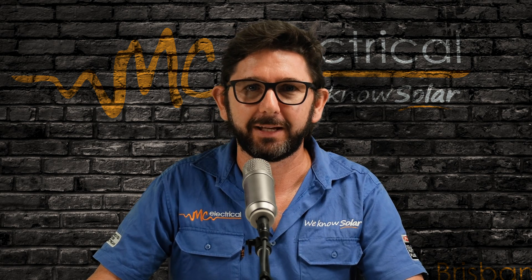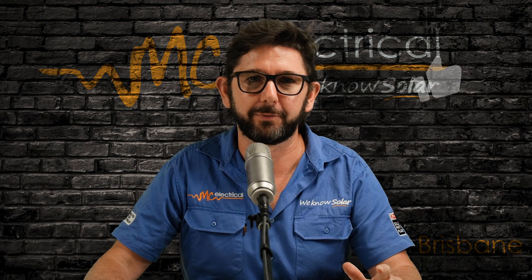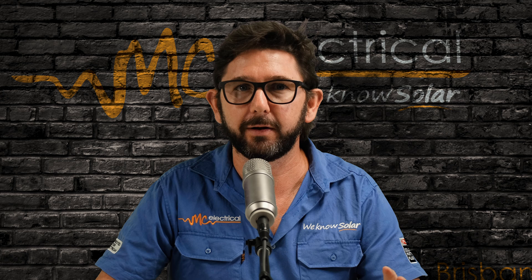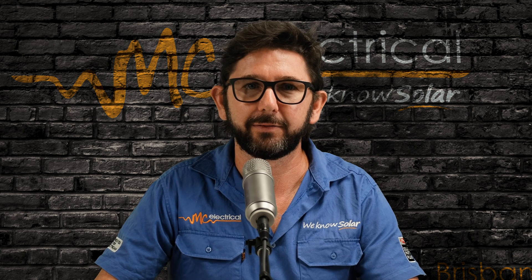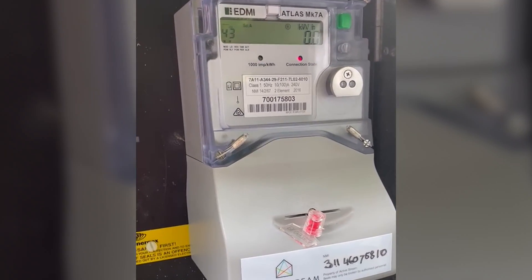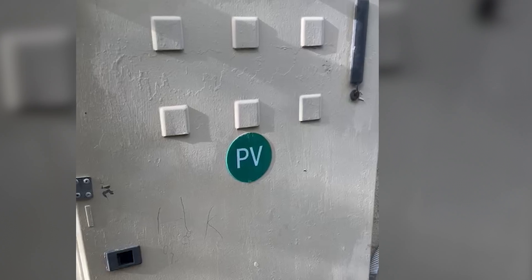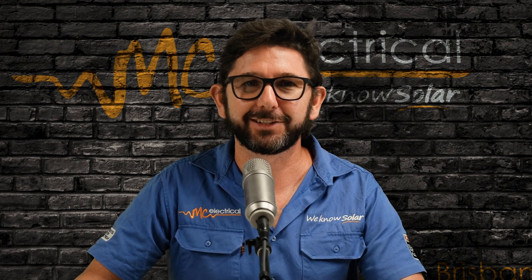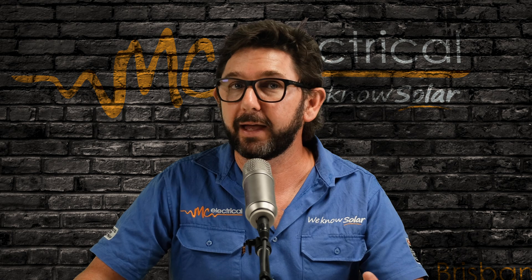Give me a thumbs up if this has helped you understand why we may have left your solar turned off. Now for the good news: if you have a type four meter, you can turn your solar on from day one. Type four meters are pretty new — they've been mandatory since December 2017 whenever a new meter is installed. You can identify them because they won't have an Ergon or Energex badge inside the meter, and they often have an external antenna attached so they can be read and programmed remotely. Type four meters are designed for solar, so leave your solar on and your retailer will remotely reprogram it for the solar feed-in tariff.